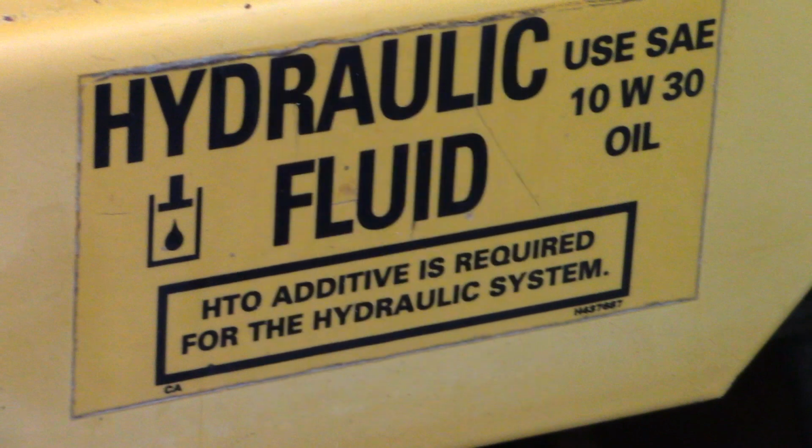I'm sure there's some guys that run HTO additive. I'm sure there's some guys that don't, and whether or not it's a real thing, I don't know for sure. I'm not an engineer, but what I can tell you is I swapped my system over to Htran, and I've had no issues. The pump is quiet. I haven't had any groaning or growling from the hydraulic system, so it's a worthwhile swap, I think, and it actually works out to be cheaper than having to buy the hydraulic oil plus the HTO additive and then mixing it yourself.